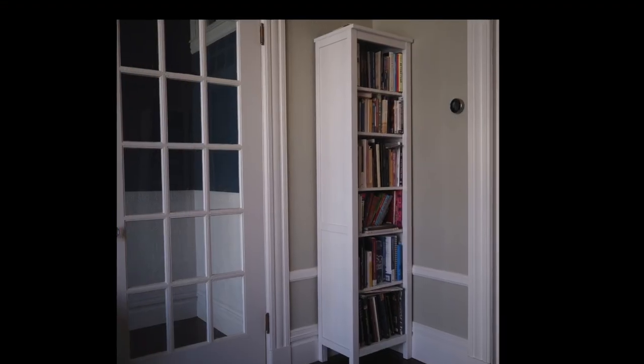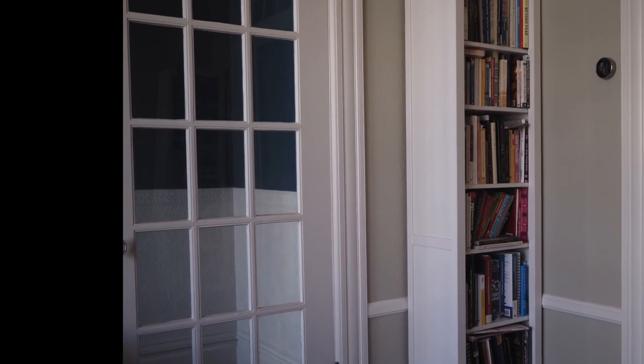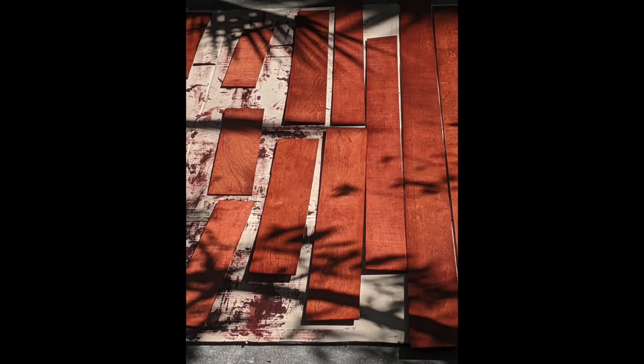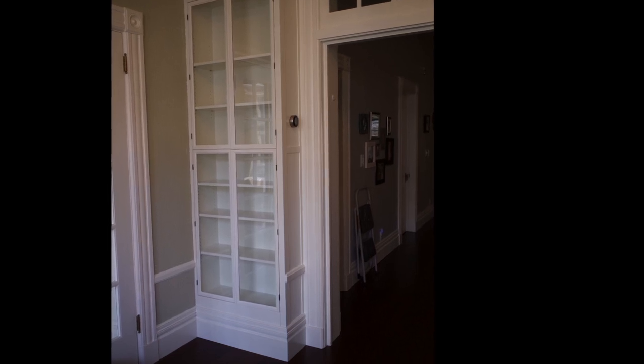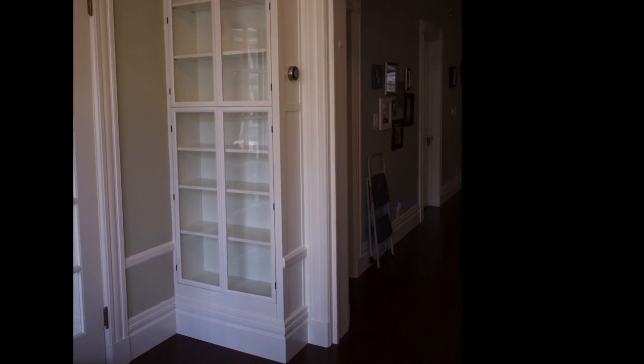I needed a light and airy shelf that fits the Victorian Queen Anne style of my house renovation in San Francisco. For a natural wood grain with an oiled or stained finish, you will generally want to opt for hardwood, or at least a hardwood veneered plywood with edge binding. Of the types of edge binding shown here, the second one proved durable on my kitchen cabinet shelves. To suit the style of my house, I opted for a spray painted finish, so there was no point in paying for hardwood or even a veneered plywood.